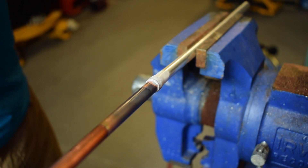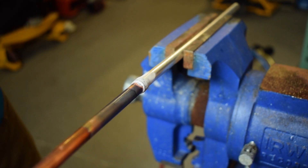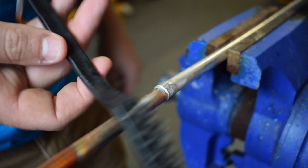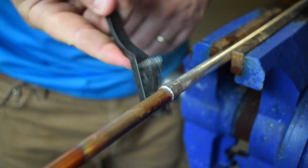Now we're going to let it cool a little bit because aluminum and copper have different expansion and contraction rates, so we want to let it cool naturally. Once that's done, we'll clean it up. The SolderWeld multi-kit comes with a little brush with a lanyard on it, which is a nice little tool to just clean up.